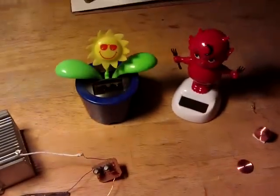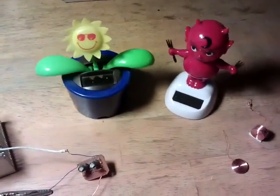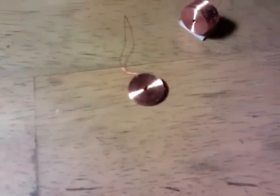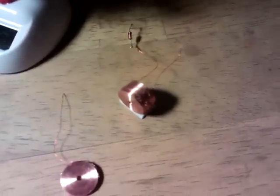This version is based on these dancing toy things you can get from dollar stores. I took the coils out of several of them — that's the size of a coil there. You measure about 500 ohms, and then stacked four together, and that gives 2k.